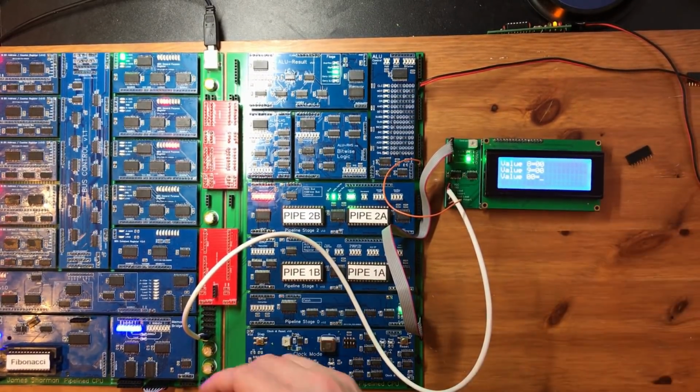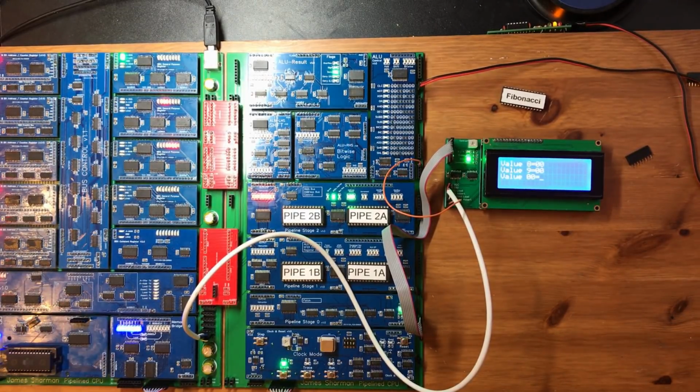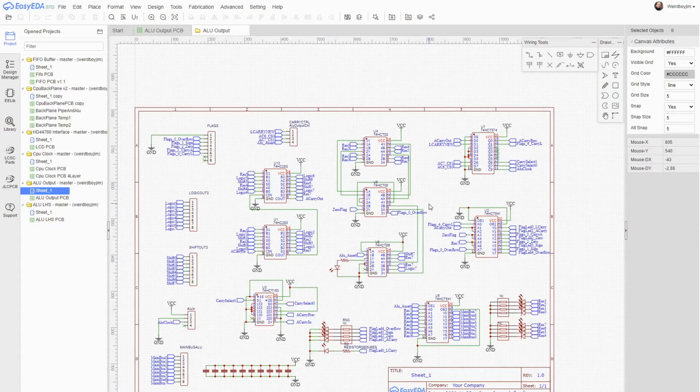So then I wrote some simple test code that just called the divide operation directly, so I could step my way through that code multiple times until I worked out where it was going wrong. And it turns out that the logical carry wasn't working. Then I discovered that the logical carry hadn't been handled.